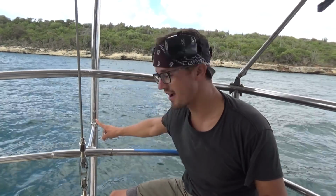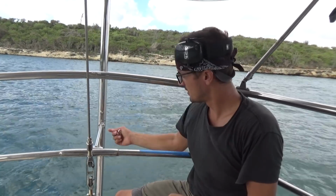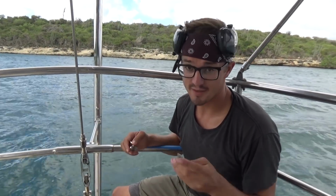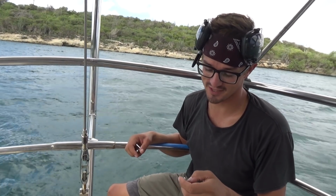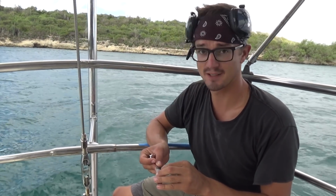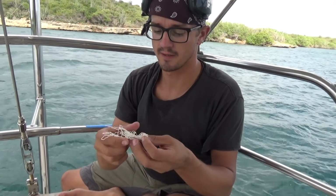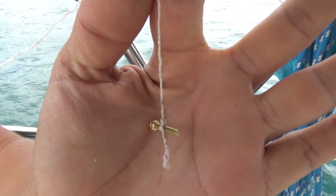Problem is that the holes are halfway up, and so you have to bring this backing plate somehow up the inside of that tube and hold it in place while you bolt the bracket on. There's a trick for it, and it's actually in the instructions for installation. I know that I normally MacGyver and DIY the heck out of stuff, but this one's actually straight out of the instruction manual. So the trick is a piece of string and a tiny little screw.